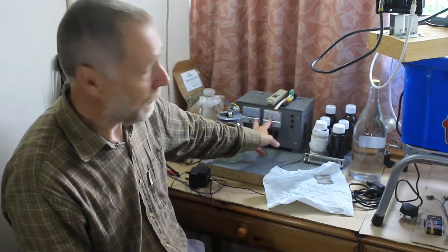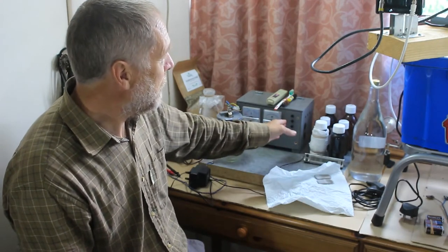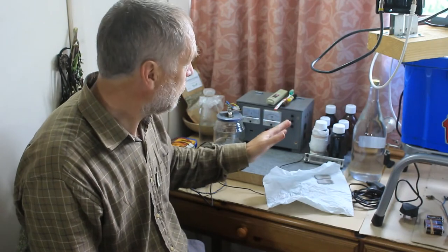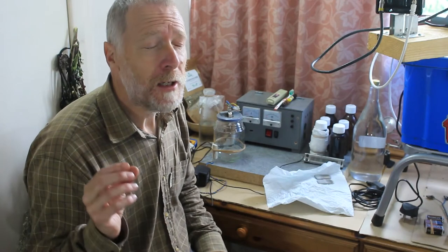The way I make it uses basically that method but with a little more complicated equipment — it's got two dials on the front, some switches, and some LEDs. Inside there is a transformer so I can run it off the mains; the transformer gives me 30 volts and I feed those 30 volts to the two electrodes through a current-regulating diode. A current-regulating diode is a little electronic device — you just put it in line with the circuit and it limits the current to those two electrodes to 2 milliamps.